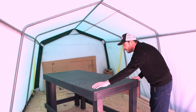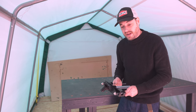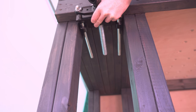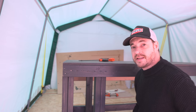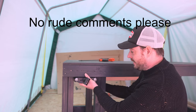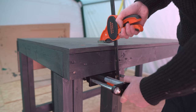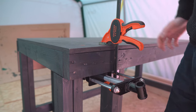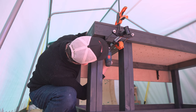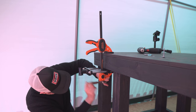Right, two down. Last thing to do — a bit of a vise. So I've got this style of vise because I think it's going to be so easy to fit on this bench, because the underside of the table is flat. This just needs four holes drilled and bolted to the underside. This is a seven inch vise and it fits perfectly in the little gap between the legs — I didn't actually plan that. So I'm going to get it clamped into place, then I can drill the pilot holes and get some coach screws with washers put in. I drill some four mil pilot holes and then these coach screws — I think they're M6s — so I get a ratchet out and get them put in.